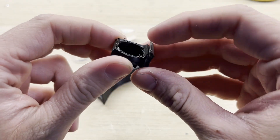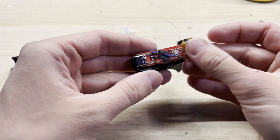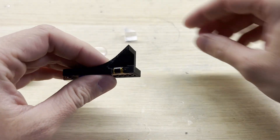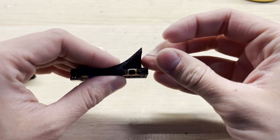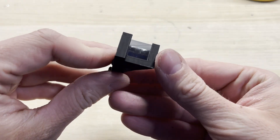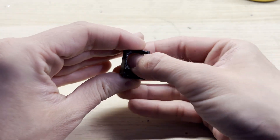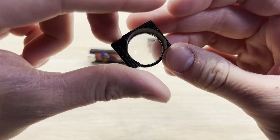The second black piece is for the optics and the combiner. I will start by installing the main PCB — it goes directly into the plastic frame, but it's very important that the display goes in first. With the display in place, you can simply push the PCB inside. With the board in place, carefully insert the prism. It goes directly on top of the display and holds it in place. It may be slightly difficult to push in but it shouldn't break any parts. Now it's time to install the lenses. Just grab the plastic piece and push the lenses inside — the smaller lens goes in first. After pushing in the second bigger lens, the whole assembly is pretty much finished.